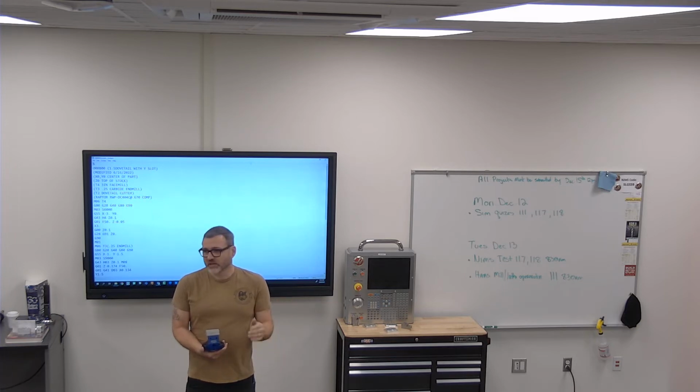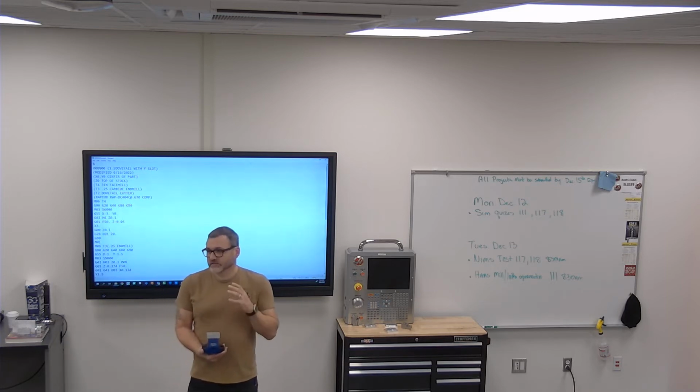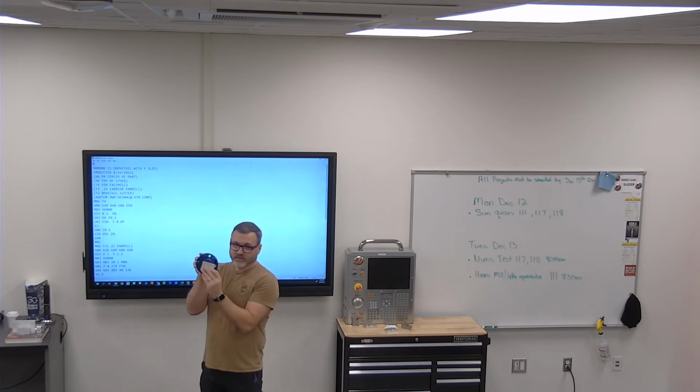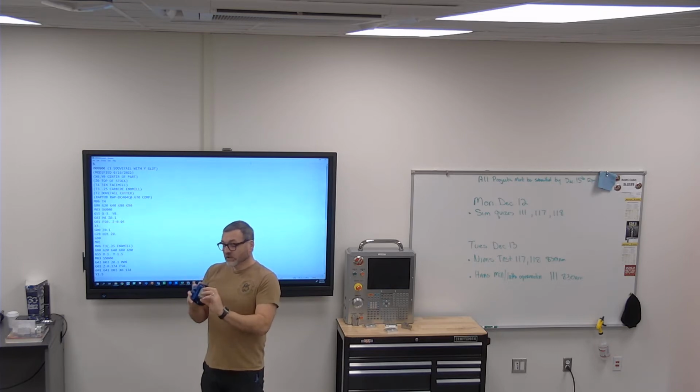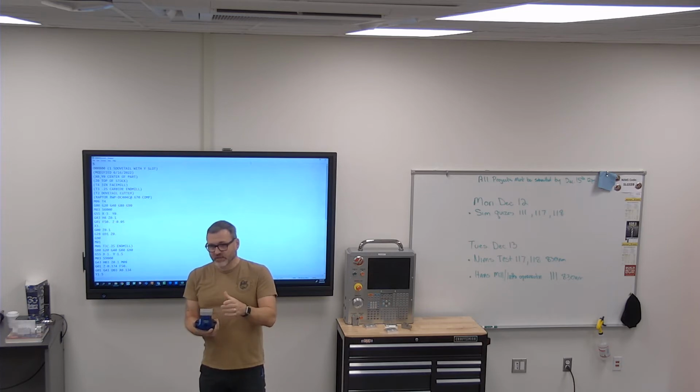Well, they were using Fusion, and so they used all the factory speeds and feeds that Fusion gave, not looking at it, even though I tell them all the time, please don't go by the defaults. You need to set your own speeds and feeds. It goes in one ear, out the other, and everybody blew out their angle hole. And so that means that when they put them on, the part was sitting like this, or like this, or like that. And so we had to make some adjustments, and some of them we made some bushings and fixed them. Some of them are just off. So anyways, once this is down and square and straight, X, Y, and Z is always in this spot.